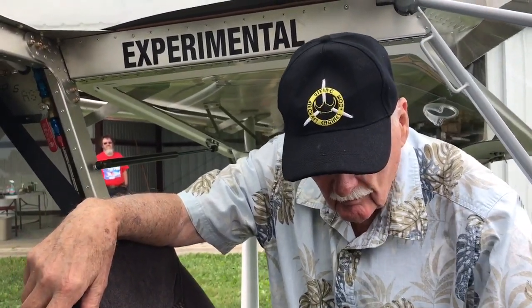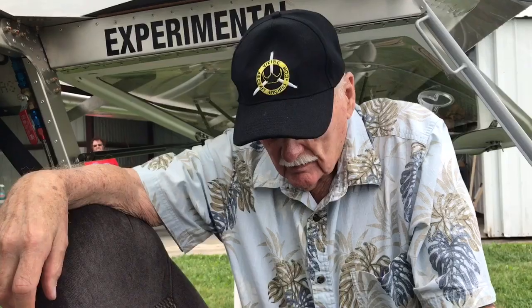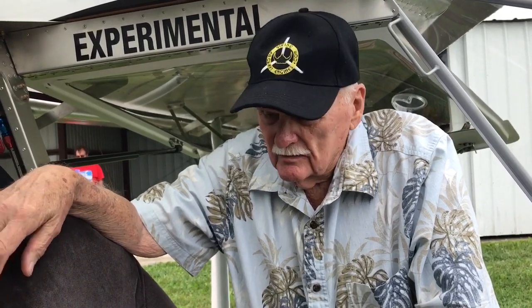Tell us about that. As you said, you retrofitted to the Viking, so you ended up putting in Viking header tanks, which had the pumps built into them. Right. Normally those are vented back to the tank, but once you've got the plane built, that's not so easy. You have to take the wings off and do a complete rebuild of the fuel structure to vent the pumps back to the tanks. I've looked at it from the philosophical viewpoint that the tanks, the Viking pumps and the tank systems are part of the gravity feed system. So once it's full, it's full.